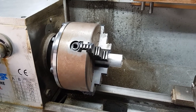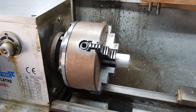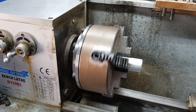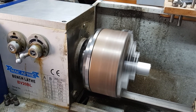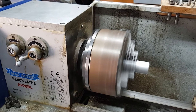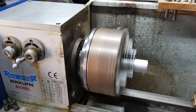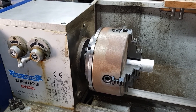It dynamic brakes down to zero in two seconds, and the inverter is even happy to go directly to reverse, although I don't recommend doing that all the time. But here we go — an insane improvement over previous performance.